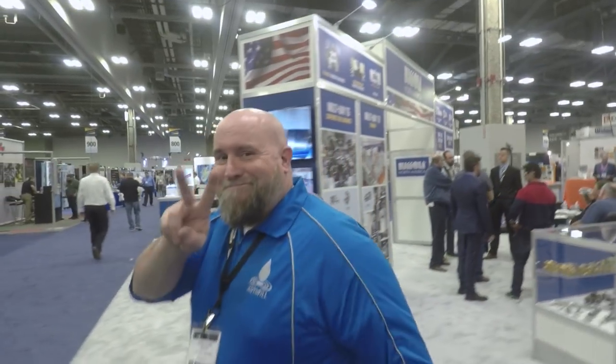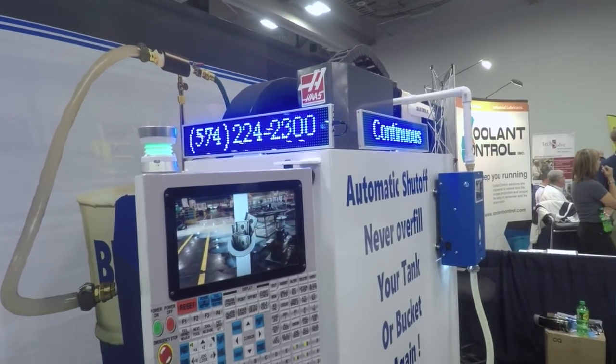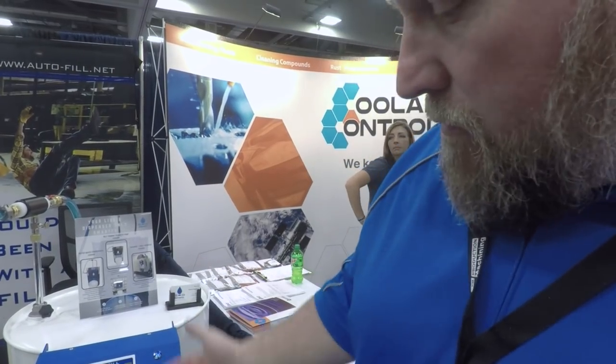Just walking around and a guy came up to me — Jason Hudgens. A guy who's done it all: run automotive machining, started a bow company, just an entrepreneur. He'd actually emailed me because they do an auto top-off system and were looking for Arduino stuff. What we came up with was — you see these videos of coolant tank nightmares that every shop has seen. What happens is a guy goes to fill the tank, somebody says come look at this, phone rings, he walks away and forgets to shut the ball valve off and he floods it. So the first thing we came up with: when it runs, I've got it set for two gallons or a gallon and a half, it'll run and then it just shuts off automatically.